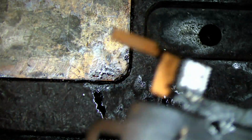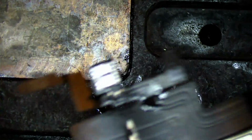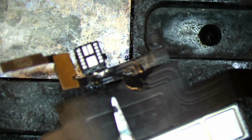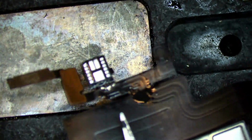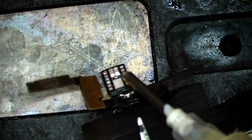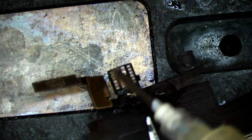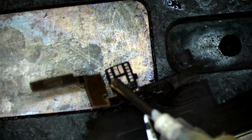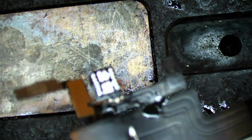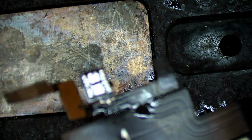All right, now that we have that middle spacer on there, let's go ahead and put the flood illuminator on. So we'll go ahead and add just a little bit of flux to move this over. We'll add a little bit of flux just to the top of the sensor. We don't need much. And then we will go ahead and get this ready.